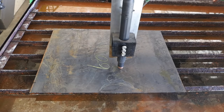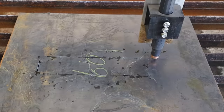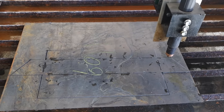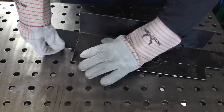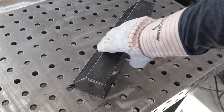Since I need two of these products and it would be interesting to compare, I'm going to show really fast how I would do it with the more modern tools I have. I've drawn this part up and created a tool path for my CNC plasma table — it'll be cut out in a matter of just a couple of minutes. Huge time savings. If you don't have a plasma cutting table you can use a local supplier or a mail order supplier like Send Cut Send — I've been pretty happy with their service. Now that it's all cut out with the slots linked in, I can bend it by hand with gloves on and everything fits together pretty nicely.